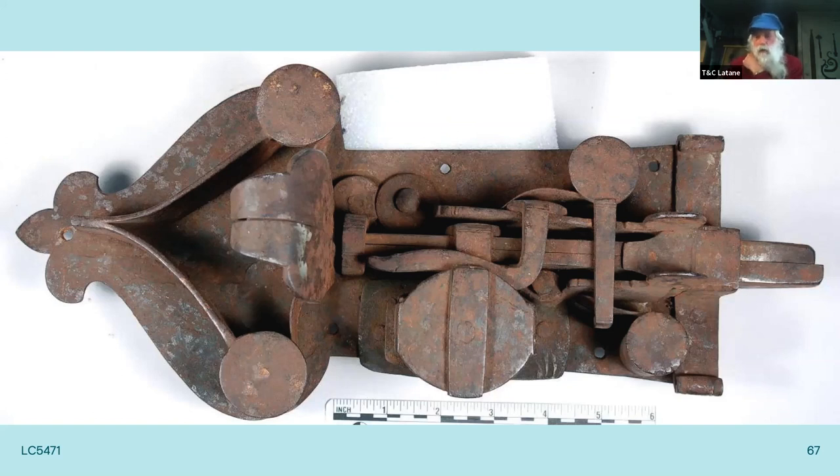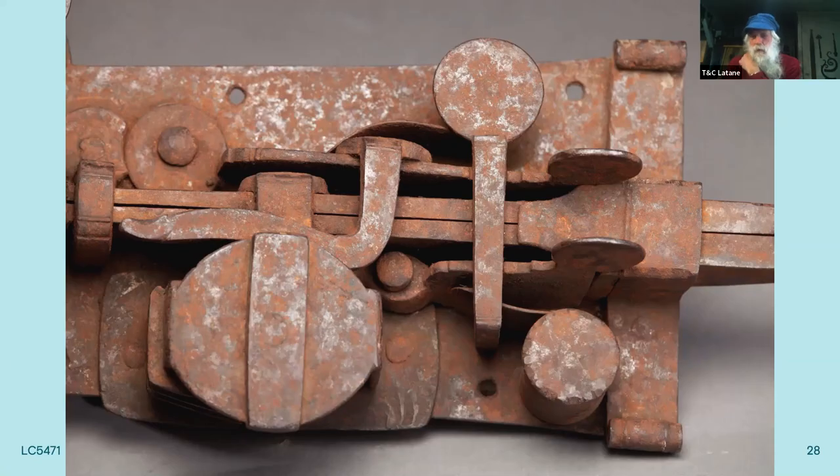There's a bevel on the corners of the staple that was filed in. Generally, because of the way things bend, you get a squarer corner near the edge than in the middle. So they beveled. You can see the bevels, the little bead filed where the extension starts, and then the beveled corners — except all the way at the outside edge, which was left square. That chamfer stops before the end. On the upper side, the file work on the scroll ends as it approaches the lower side of the scroll.